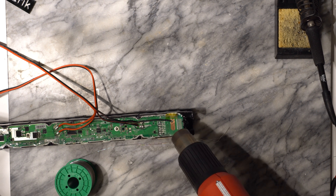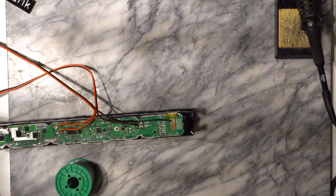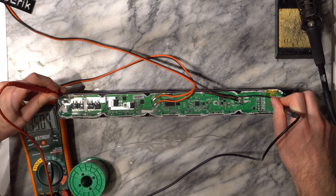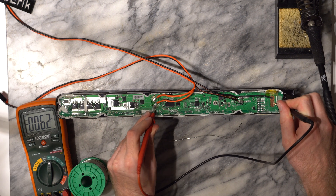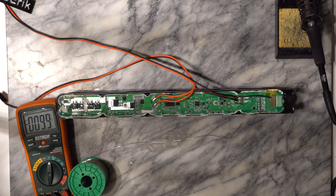At this point you are done and all you have to do is make sure that everything worked properly. We can verify this by measuring a few voltages on the battery pack — specifically the main cell voltage and the motor plus output voltage. If they are within a few millivolts, everything worked properly. If they are more than about a quarter volt apart, you probably messed up your soldering.